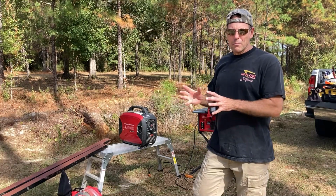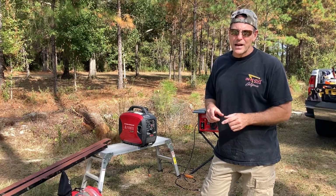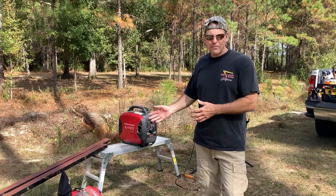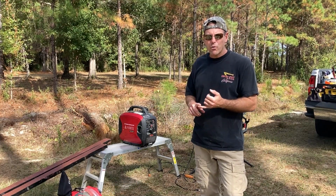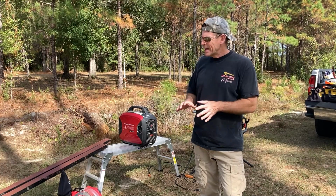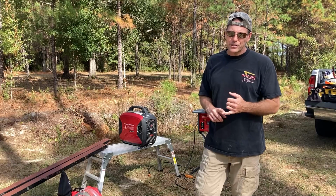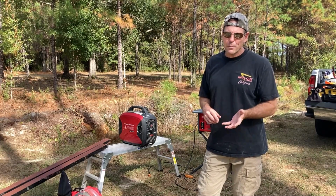But I'm out here on my section. It's the last ladder that I have to rebuild because the wood rotted. You'll notice that the wood I have is treated wood, but I dried it for a week or so before I painted it, and then I painted it on all four sides. I did that to give it extra protection from the elements, but also because of carpenter bees.